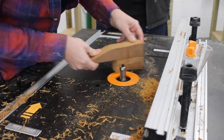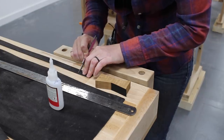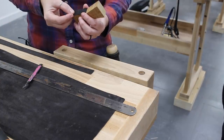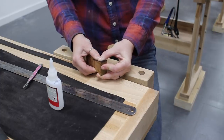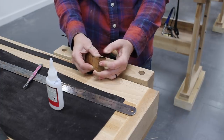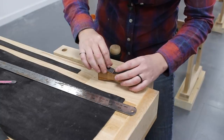After making one copy I peeled it off, then used more masking tape and CA glue to stick on the other one to make a third. I was a little worried about the roasted sycamore bow ties blending in too much with the light alder body, so Chris suggested outlining them in black-stained holly. This was a time-consuming step but definitely worth it — I used a scalpel to cut a length of holly just slightly oversized then attached it using CA glue.